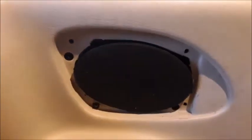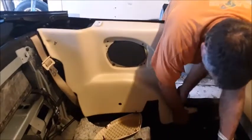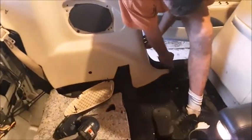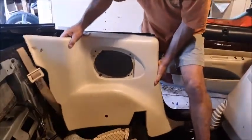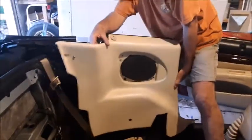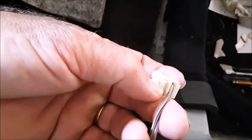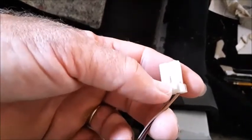There are a couple of screws here that are holding this body panel onto the frame. After getting those two screws out, it has one snap at the bottom — it has this metal plug that goes underneath there. Once you get that out, it lips up and out. The speaker is still going to be attached though. The speaker clip has a little button on the back side that you have to depress when you try to pull it out of the socket on the back side of the speaker.